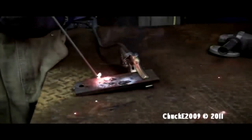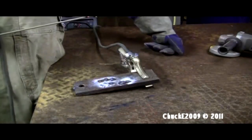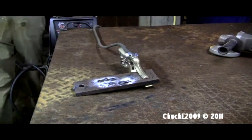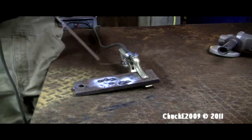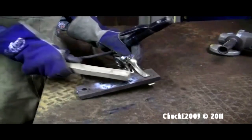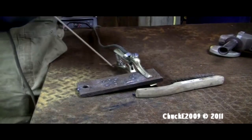Just like that — you just tap it against the metal. Let me come over here and give this welder a few cranks up — actually just a crank and a third feels about right. So I'm going to use the blindly stabbing method to start an arc after I clean this flux off. When it's on the electrode it's flux; when it's on the piece of metal it's slag. You don't want to weld over it — you want to get it all off. Blindly stabbing method, here we go.